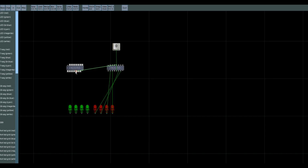So that will go to this pin on the other side, and again we can connect the pins to the LEDs in the same order. We've got bits 1, 2, 3, 4, so bit 5, which will be this LED, will go to this pin here. Then we take the second bit, same as the right hand side, to this pin here, and the third bit will go to this pin here, and the fourth pin, which will be our 8th bit, will go to here.